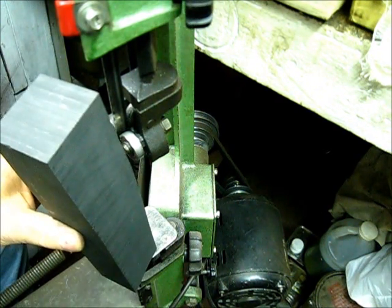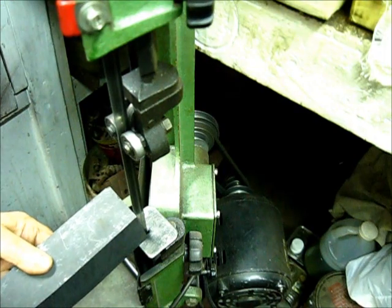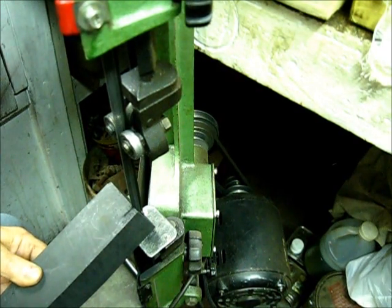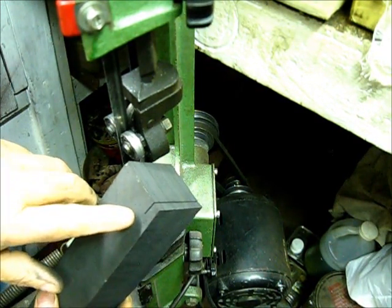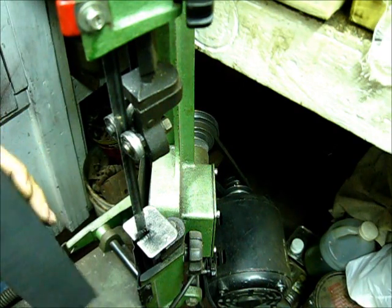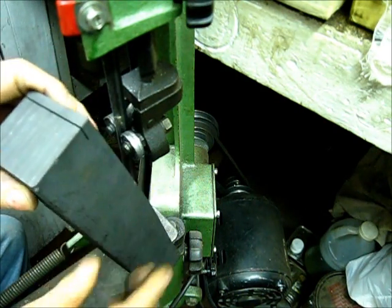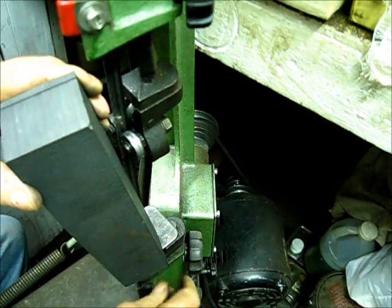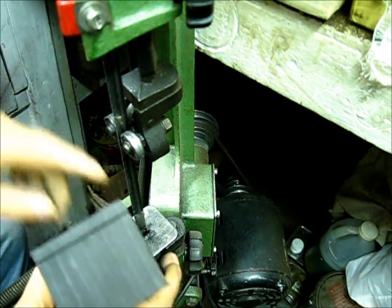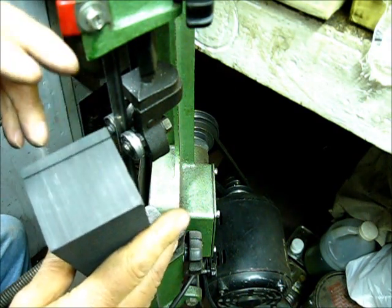Let's saw off a couple of pieces. We're going to saw it about one quarter of an inch thick — two inches by one quarter by a foot long. When I saw this, at some point I'm also going to saw a couple of little strips, maybe a half inch by a quarter inch by a foot long, to clean the inside of cylinder sleeves with. This large piece is just too much surface area — I'll show you.